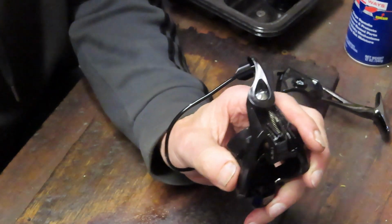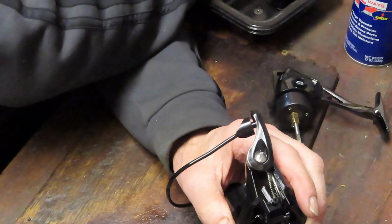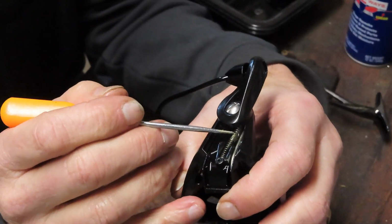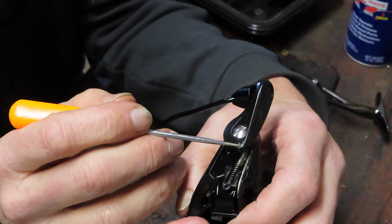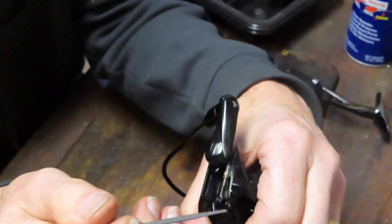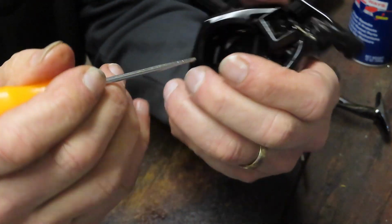So this is kind of a traditional setup in the way that they put bail arms together. We have a long spring, then we have a metal rod that goes inside of that spring, and on the tip of that rod you're going to have a 90-degree angle coming out. A second one now, we have a Z-bar. We have a long arm that extends under the case. That's going to be your trip lever.